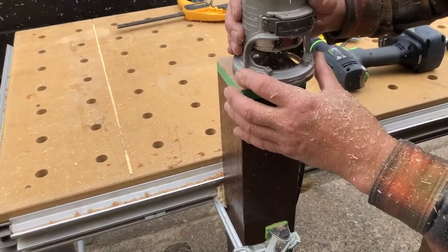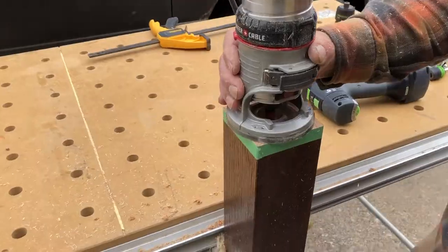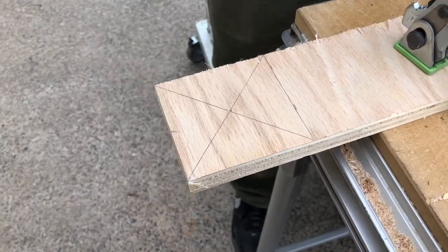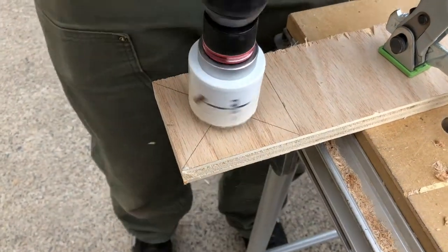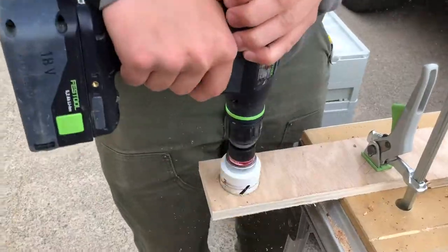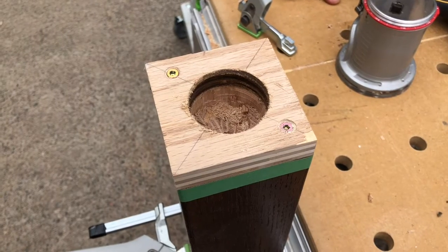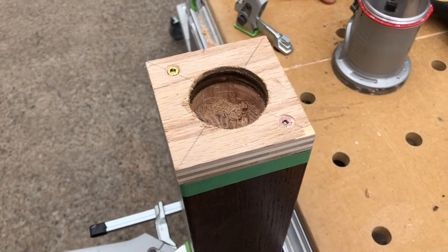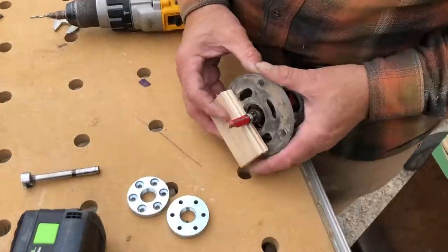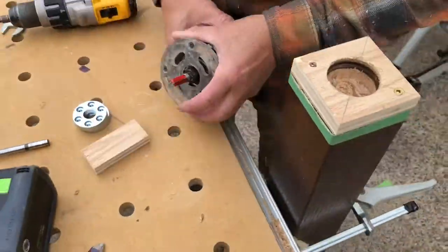After that, I'll use a three-quarter inch plywood template and a template bit to route the remainder of the hole. The total depth of the hole needs to be thirteen-sixteenths of an inch, and that is easily accomplished with the template and router bit. I'll store that template in my toolbox for future jobs using the Fasten-Fast fitting. I've placed a link to the Horner Millworks website in the description of this video.